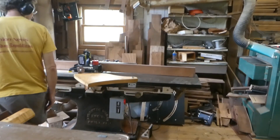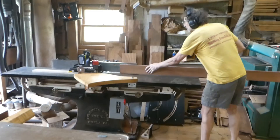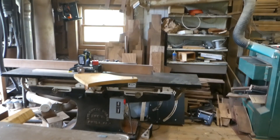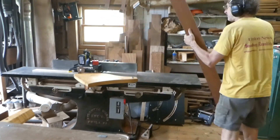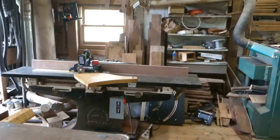The material here is 6-inch wide leopard wood, a dense Brazilian hardwood. As you can see, the board has a pretty substantial bow — a good quarter inch. So it's going to take me four passes to straighten it. This is an old jointer with a Shelix head I had made to fit the existing Babbitt bearings, so it runs at a slightly slower RPM than a contemporary jointer with ball bearings. Shelix heads also require more power, and I've only got a two-horsepower motor, so I can't take off a huge amount of material at once. But I get a wonderful tear-free surface, very flat even on a large board.